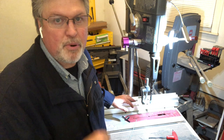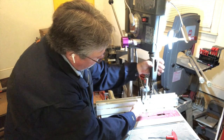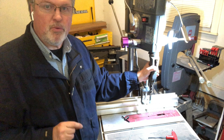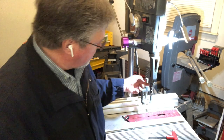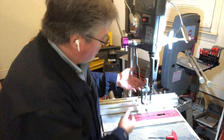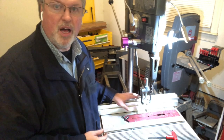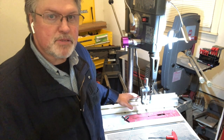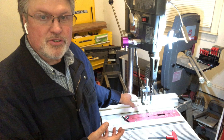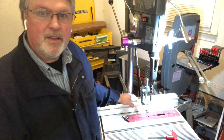I've got the proper clearance below. You've probably seen videos that talk about using a dime to get this spacing — you put a dime at the top, slide the chisel in leaving a dime-sized gap, slide the bit all the way up until it bottoms out, tighten it, then remove the dime and move the chisel up. I find that method works fine with old ShopSmith chisels, but doesn't give quite enough space with Japanese-style chisels. So I just make sure that lifting surface is extended a little bit further down.